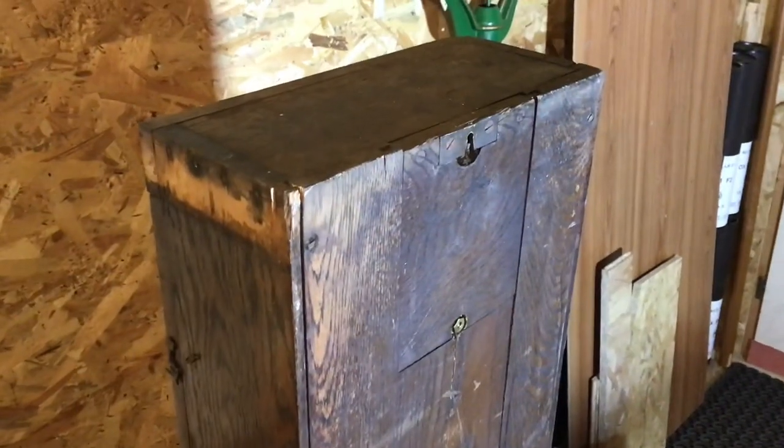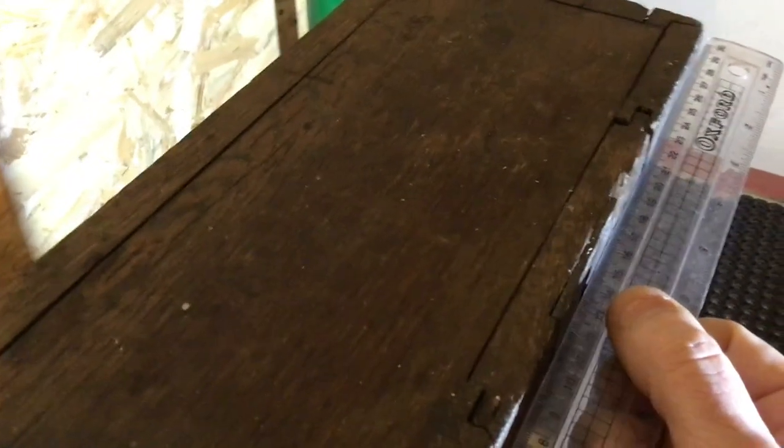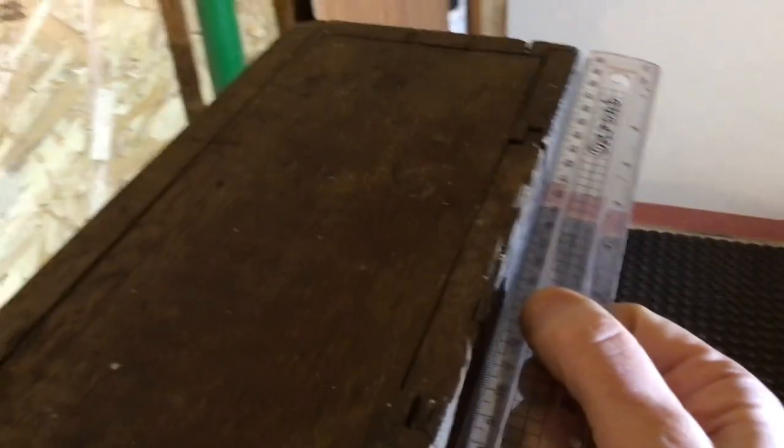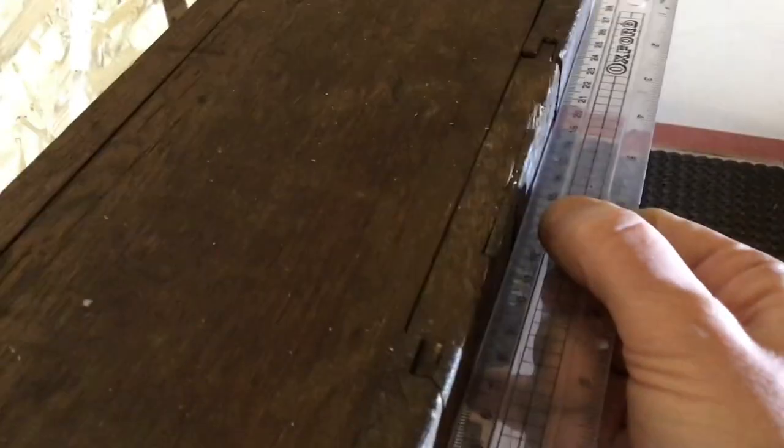Before you hang the clock, see if the bracket, top hanging bracket, is flush with the back, or whether the clock is bent, or any of those. I'm going to put this ruler here, and this tells me that the bracket is very, very slightly proud and it will be flat against the wall. The reason for this is for when you're putting the screw in. So we take a screw.